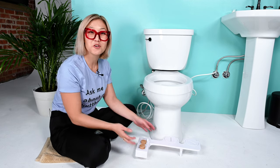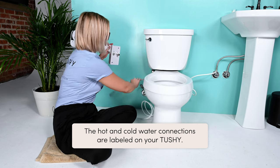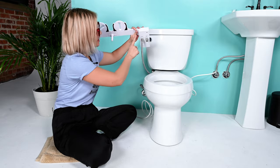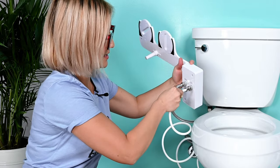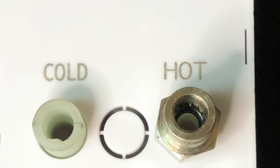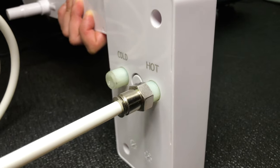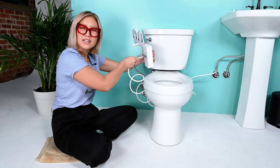Now it's time to connect your water connections to your TUSHY. Flip it over and you'll see a cold water connection and a hot water connection. Grab your steel flexible hose — this is your cold water connection — and screw it on with your fingers. Remember, fingers only, because over-tightening is bad news bears. Now grab your polyurethane tube and insert it into the hot water connection. Use your other hand on the front of the console for a little extra pressure. The connection works via internal barbs that grab the tube and seal from the inside. Insert it all the way until it doesn't budge. To remove it, press down the collar. To verify it's in correctly, give the tube a gentle tug — if it holds, you're good to go.